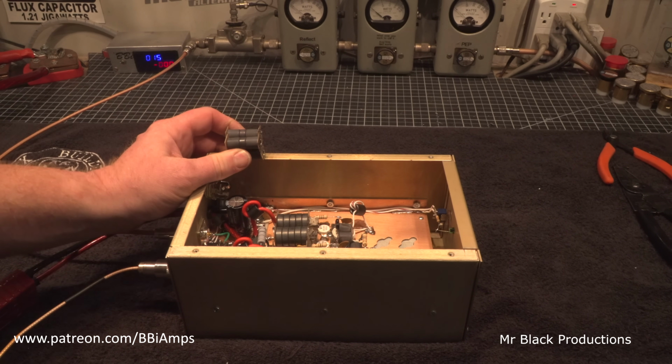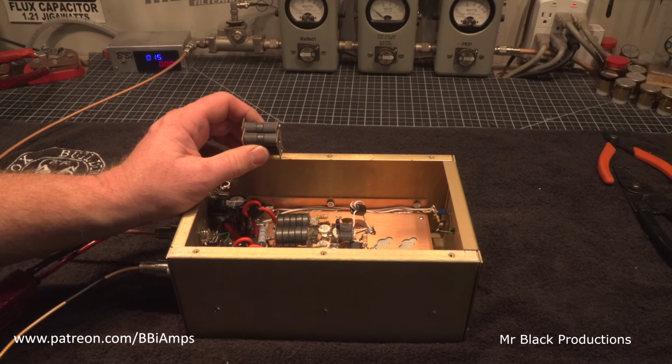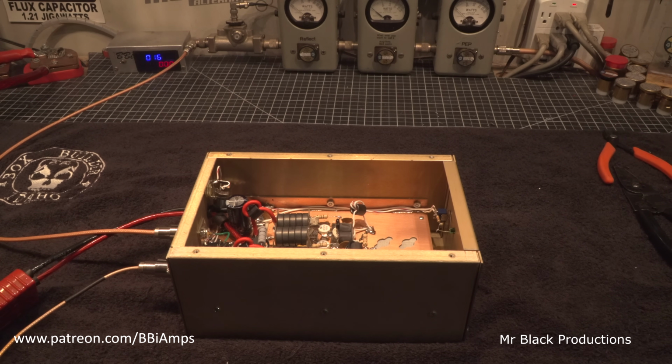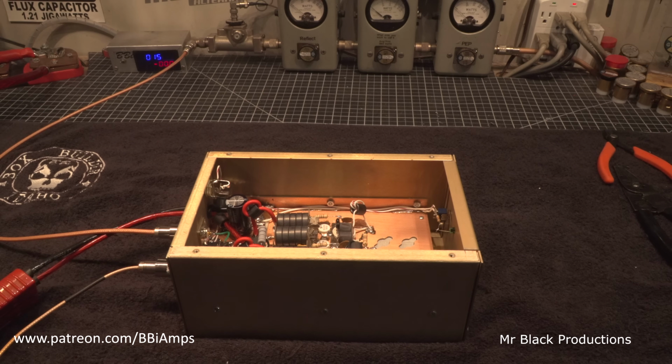These worthless sacks of crap. I think these are type 67. I did a test on these and it was leaning itself more towards type 67. These were junk. So we replaced the 500 and the 480 capacitor here. Replaced it with 1200 puff.